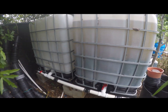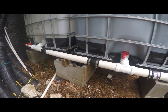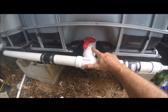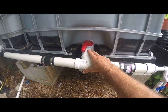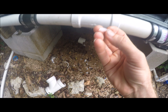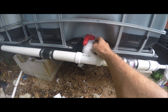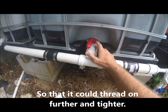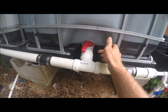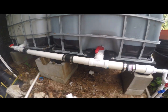This was two tanks that have been here for a while. I recently had to cut this pipe — that was like a $20 expense and some inconvenience. I put Teflon tape on the threads knowing they were going to be permanent joints, and they still leaked. So what I had to do is go in with an exacto blade and shave off the shoulder of the threads on the male end. If you're doing something like this, I'd recommend doing that in advance because the pipe thread on the PVC just would not hold.